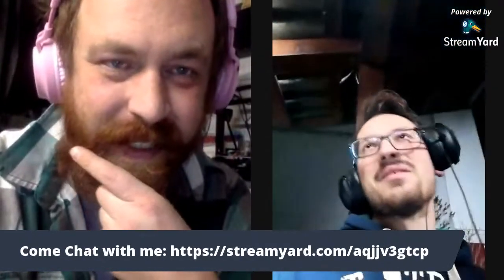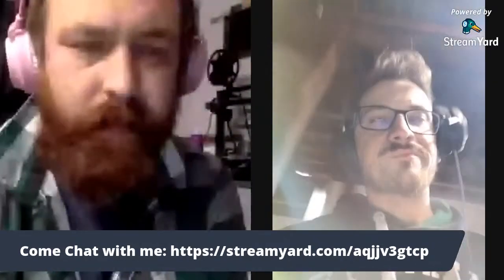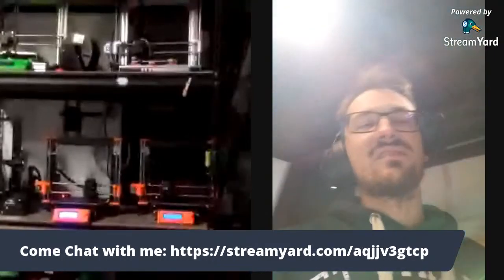Of course, but at least for the Pentacon 6, it doesn't have the tracks. It just slides between the chassis and the main body of the camera. So just that square felt on the back of the camera, I don't know, it binds or something like that if it's not the correct thickness. I will keep experimenting, maybe even ordering some Aki Asahi shutter curtains to see if I can cut it, or maybe laser cut it at the Maker's Cafe in my city.